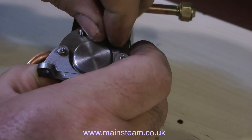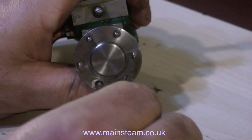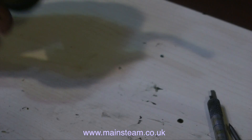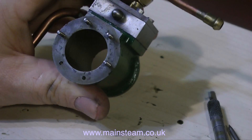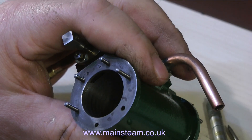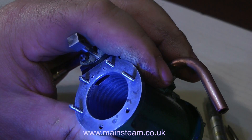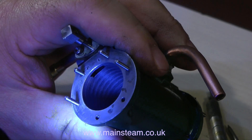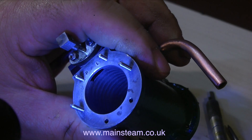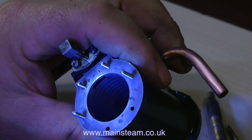I'm removing the other cylinder cover to have a close look, because if it looks as bad as it feels, then I have a problem. With the cylinder cover removed, you can clearly see the ribbed effect. This is the worst I've ever seen — it's really grim. I'll turn a light on it so you can see it. I'm really puzzled by this; the engine is generally very well machined, but the machinist must have had a day off when he did this. I do have a cylinder hone set, but it's not particularly good quality and these are very deep grooves.